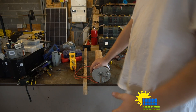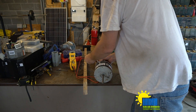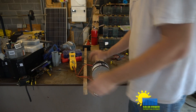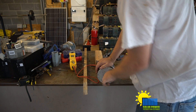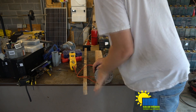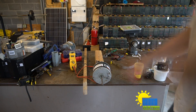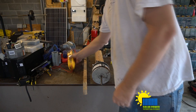There's 84 volts right there — not bad. Let's switch to the other one: 76 volts. Pretty much similar. Let's check the last one: 90 volts. So somewhere around 70, 80, 90 volts each time I try to spin it with my hand, which is pretty cool. That means they're probably all the same winding.